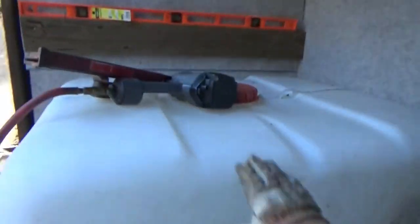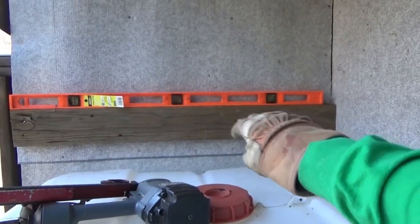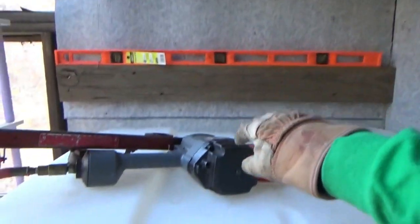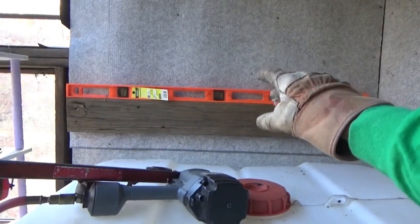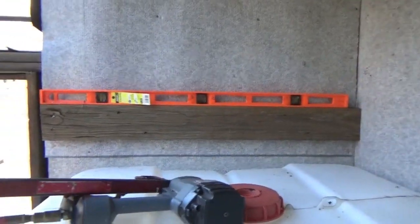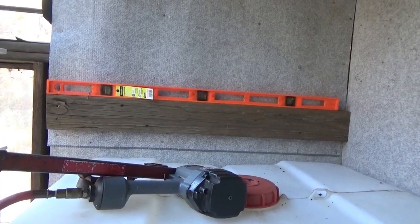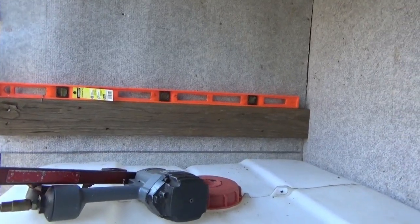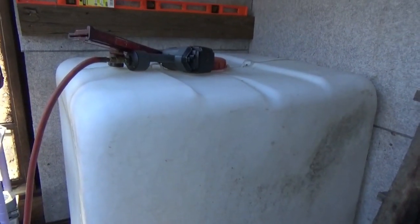I'm building a platform above the tank. This pallet is going to sit on it to hold a grow bed. I tacked it in on one side, then leveled it and tacked it on the other side using the framing nailer — this is my friend, it makes working one-handed very nice. Now I've got that tacked in. I'm going to get some larger nails and put two or three nails per stud, giving me four wall studs to hold the weight of two small grow beds, which will go up on top here for lettuce. Then I'll start framing in the pallet as part of the grow bed platform and framing for the water tank, so it cannot bulge or sag.